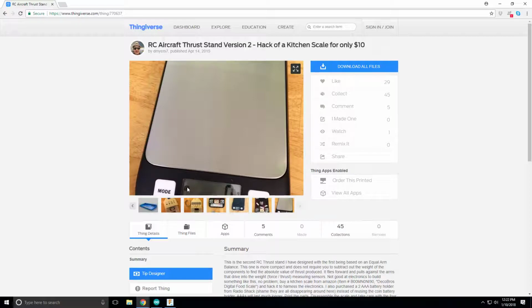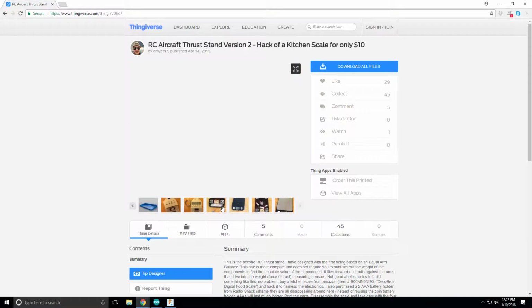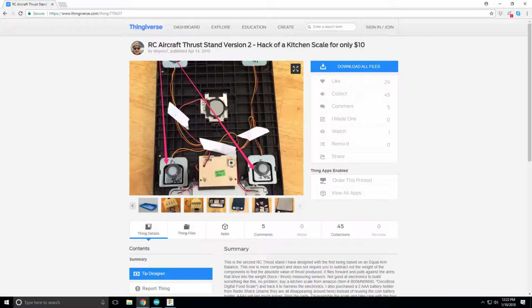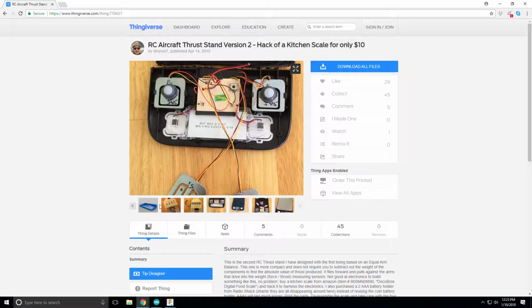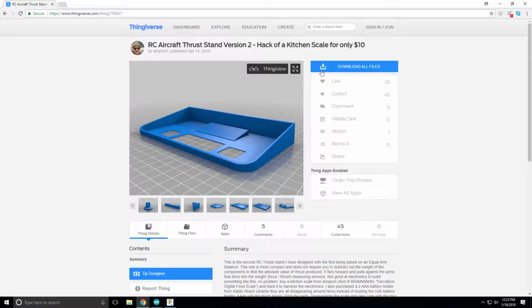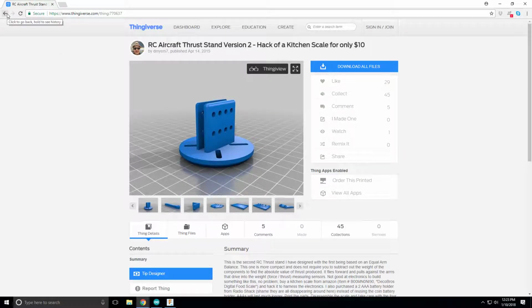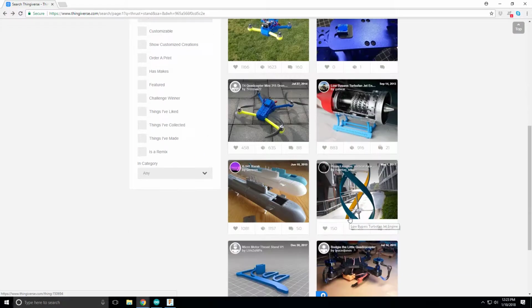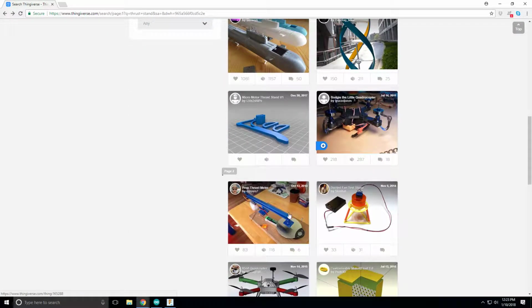So that's why you'll see some of the scales will say up to 500 grams or whatever, because past that point, the resistors cannot measure anymore, pretty much. And also, if you go too far, you will permanently deform these load cells. So yeah, this is kind of the idea of integrating an already existing scale into one, but I want to show you guys the conventional kind of one.